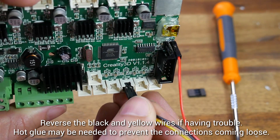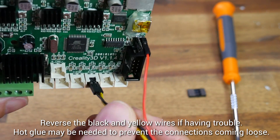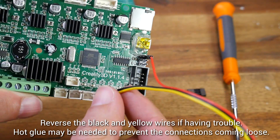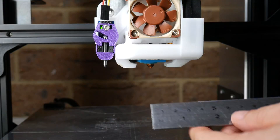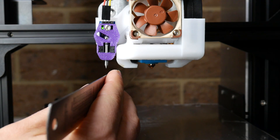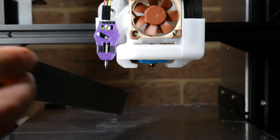Our short loom now has three single female connectors on one side ready to plug into the main board. The black and yellow go into the Z end stop plug as shown. You might need some hot glue to stop them wobbling loose, and the red 5V source comes from the pin closest to the USB connector on the in-circuit programming header. Your final job is to measure the distance between the probe from left to right and front to back compared to the nozzle. Once you know what you need for your printer, this should be quite straightforward, and the wiring is simplified over a BL Touch — so if you're on a Creality printer, you don't need to spend the extra money on the pin 27 board.